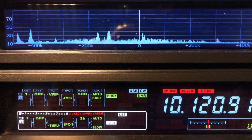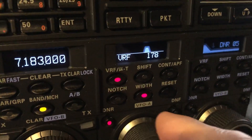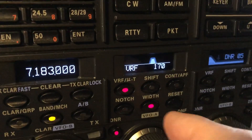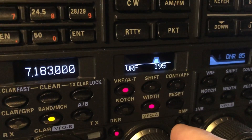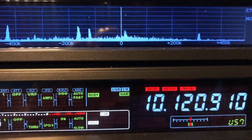The VRF — I'm going to engage it. You adjust it over here and you can select from these various LC networks. You can listen with your ear or watch the S meter and you'll know when you're centered up on the frequency you're listening to.